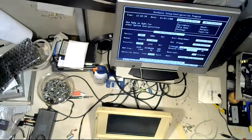What do I do? As enter hard disk fixed drive with arrows to move, escape when done. Use backspace, space, backspace. Okay, all right. So I'm guessing here. It's not a 10. Is it a 20? How many do we have first? Let's go through that. It's the standard 47 types. Okay. Oh, there's more. How did I guess this? Okay. I think that's why I took this apart to look at.